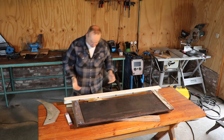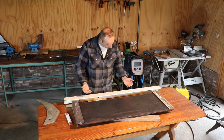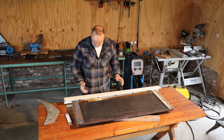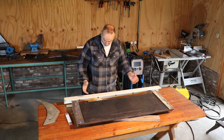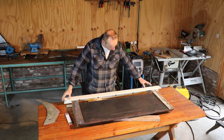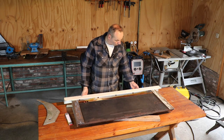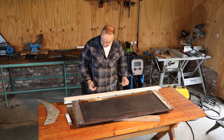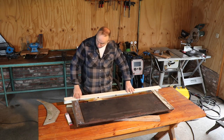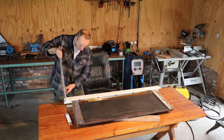The interface of the Kubota front loader is connected here, and the bottom part of that will stick out a little bit underneath. Now with the digger I will really go into the ground. So to protect the Kubota front loader, I will have this strong beam, this strong construction going around it, so that it will always shield the front loader interface from whatever I'm trying to dig up. Now this is a very strong construction. The rakes will be welded to this strong beam.